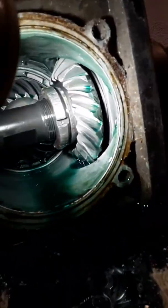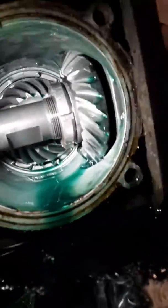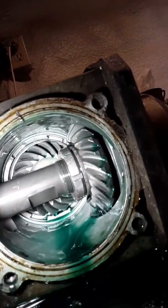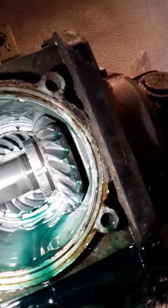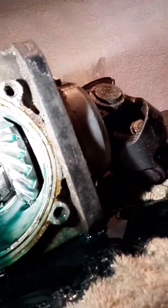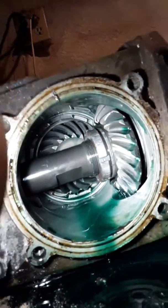It doesn't look like they've been chewed up — just looks like new gears. I can also tell that that ring has been taken off with a pipe wrench and screwdrivers through the spanner wrench holes. Down on the bottom gear there's a ring with little grooves in it that takes a special tool, and I can see someone has done it with a screwdriver.